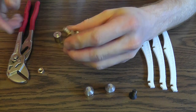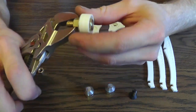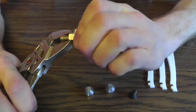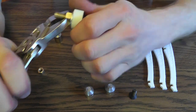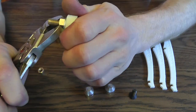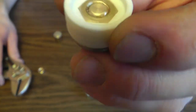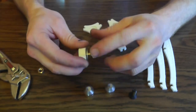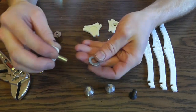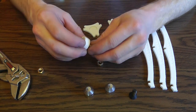So I actually use the stud and another one of your nuts along with a washer so you don't pull it out of the bottom, basically, and just tighten it down on there, and that will pull the stud with the nut on it into the bottom bismuth holder. It should be flush with the bottom. If you get a bolt, it may actually be undercut where it's too low. That's not a problem. Just pull it so it's square. You basically want it tight against the bottom.